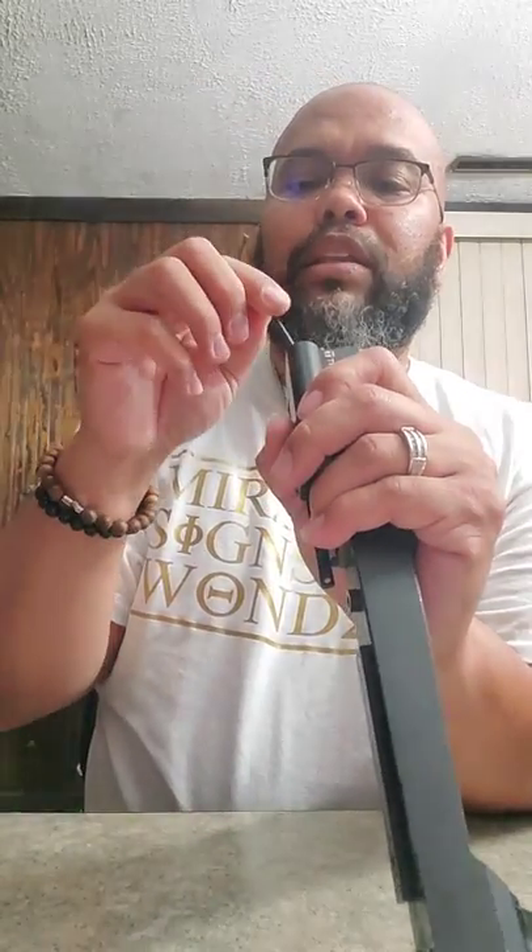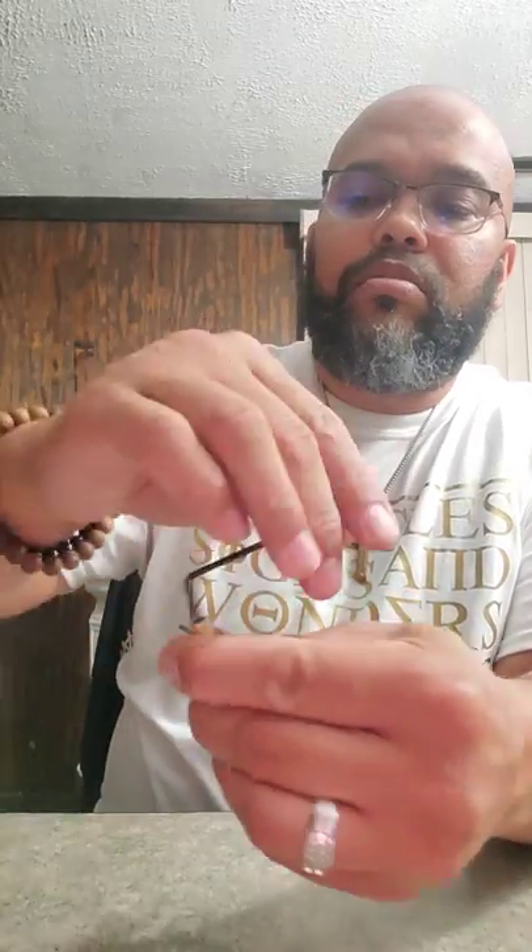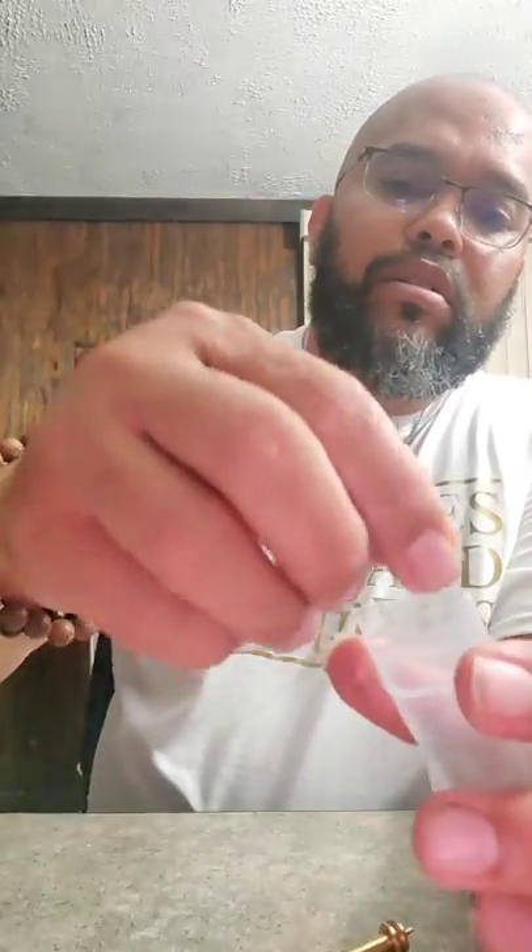Take my Allen key, put it down in the PRV valve so I can just wiggle this out — there's some vacuum in there from the O-ring and the chamber that makes it somewhat difficult to just pop out. There we go. I'm going to simply unscrew this carefully because it's under spring tension. So I've got the hollow hold-down screw, the spring, and then there's this little valve. I'm going to take all that out and store it in this little bag for future reference.